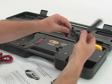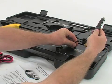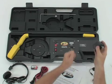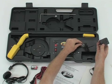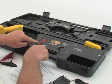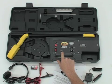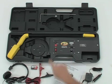The Pro800 can be recharged at any time using the included charger cords. Plug the charger into the transmitter charging connection located on the battery compartment cover, and plug the other end into a wall or car charger outlet. It may take up to five hours to recharge a completely drained battery. There are marked LED lights on the transmitter indicating power on and low battery. The low battery indicator LED will light when the battery power has been diminished, illuminating at approximately 10 volts, and as power gets weaker, the LED will continue to dim.